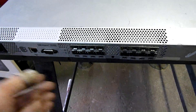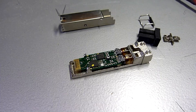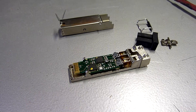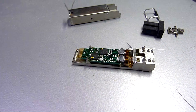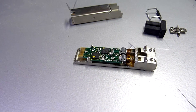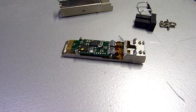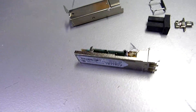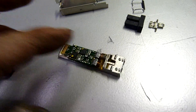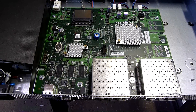The rest of this is going to be a very fast switch — a gigabit switch. Anyway, a few screws to take out and I should be able to pop the lid off. That's what's inside one of the little modules — I'll have to pop that under the scope. Basically a little converter module. You can see a pair of optocouplers on the front: one's obviously transmit, the other's receive. And there's two ICs on there which do the bulk of the processing, plus a third one on the underside. Interesting stuff.